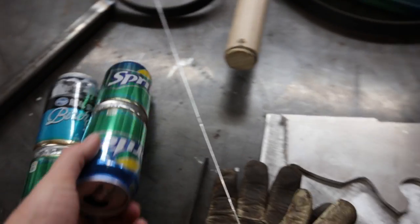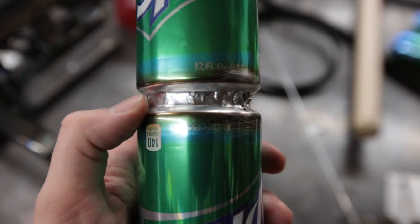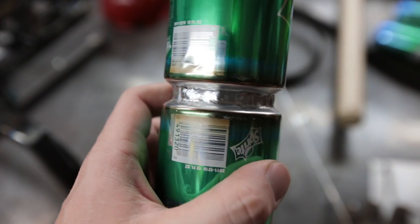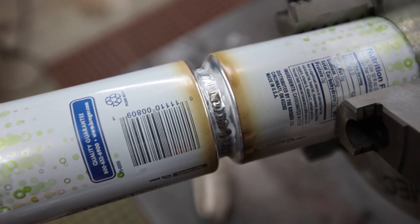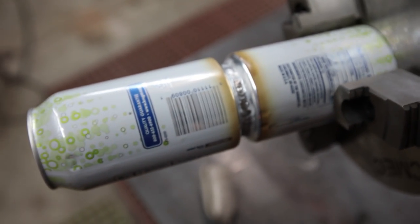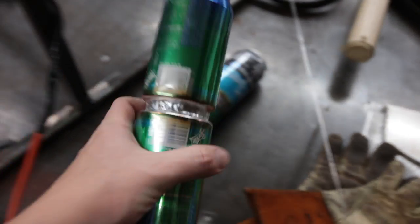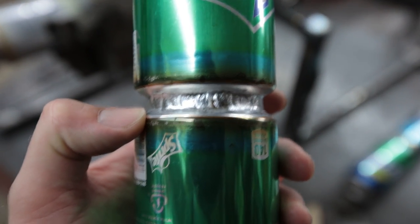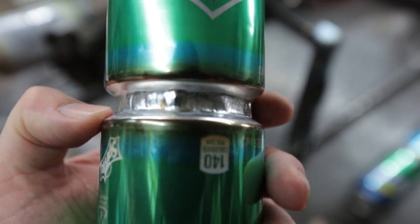I've got some other Sprite cans where I was holding the rod in the puddle and letting the positioner do the work — no ripples or anything. On this one I was actually dabbing. So just trying to feel out what works. On this one I was using 1/16th 5356 filler, and on these I was using 3/32nd and doing a lay wire.